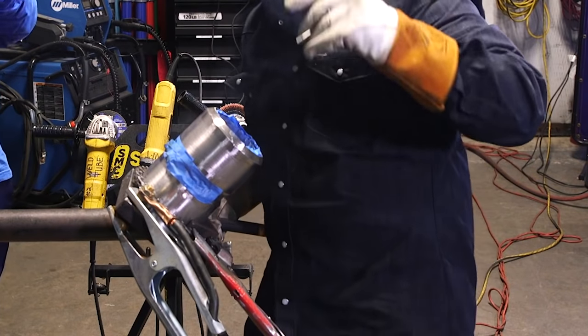Just a nice and easy movement side to side, making sure you're breaking down the bevels. Try to keep the feed nice and even from your wire. I like to keep my tungsten pointing in towards the center of the weld — it helps make sure the arc breaks down the walls inside, especially on our root. Keep your tungsten straight in. As we're coming up to our tack, we continue to follow through, make sure we get a good tie-in, moving nice and easy all the way through. Our tie-in looks good.